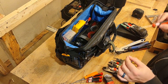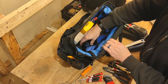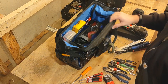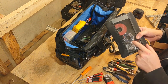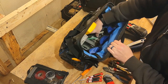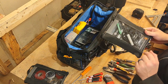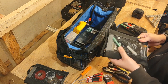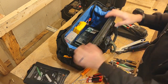I have a cobalt handle that pairs with the allen key set for higher leverage — works really well. I also have a couple of tool bags: one has electrical tape, a spool of velcro, Teflon tape for air and water piping around automation equipment, a solder kit for when you have to rewire and solder something, and heat shrink tubes. You don't really use heat shrink much in automation — normally you go to a terminal strip — but I have them there if I need them.